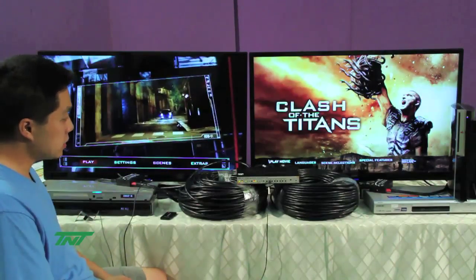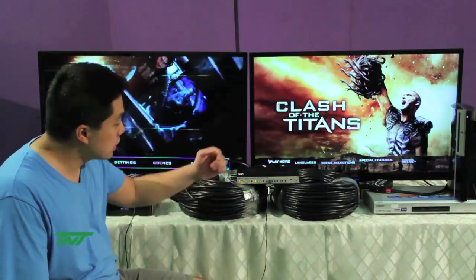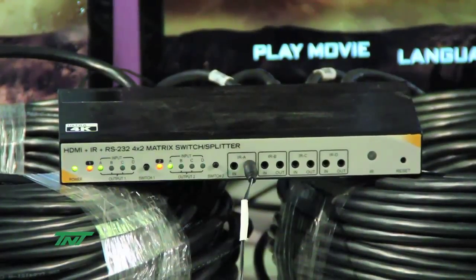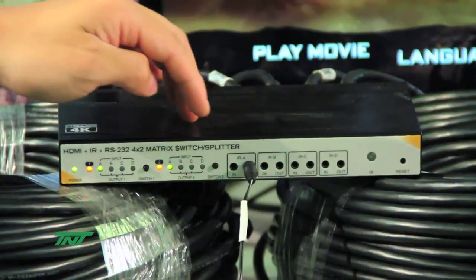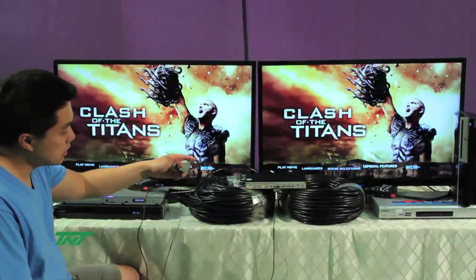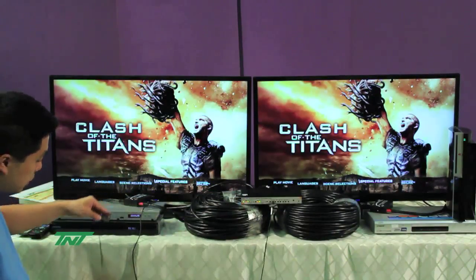Now on to the IR function — the front IR ports. I told you I was going to show you what they do. Let me switch all outputs to one. When you switch to the same output or switch to something different, these will flash — that's normal because it's re-syncing. I'm going to show you the IR function I set up. I have one right now plugged into the IR out. Near the player, I have a sensor connected to this port — this is the sensor right here, on a metal stand. Since this is a matrix, this transmitter unit will be near our sources — that's why I have the IR out with the remote close to the player.